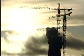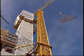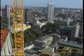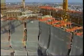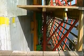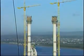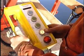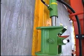Tight deadlines force the site to raise the formwork in any weather. Insufficient craneage and limited safe working loads are a bottleneck in the construction sequence. Moreover, the general lack of space on confined sites makes it impossible to store the formwork on the ground. PERI ACS solves these problems, enabling climbing to take place without the crane in any weather and at any height. Sophisticated technology with hydraulic drive, remote control and practical design makes PERI ACS simple and safe.